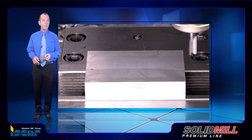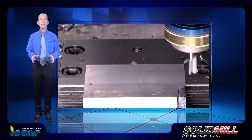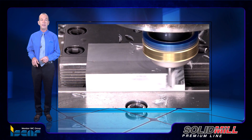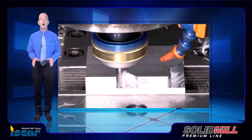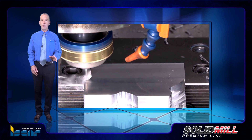In high-efficiency milling, this arrangement ensures the flute volume necessary for chip flow without increasing chatter. The majority of endmills for use on aluminum are based on this approach, and ECR B3RC is no exception.